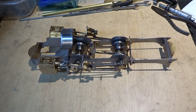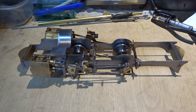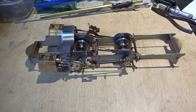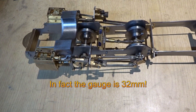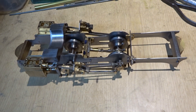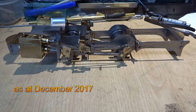So how far have I got with the Darjeeling Class B? I've sort of got a chassis sorted out, part completed, and here it is. It has working - or will be when finished - Walschaerts valve gear, that's all this business here. It will probably run on either 32mm or 45mm gauge on the garden railway. Really no drawings used, just making it up as I go along by eye. The chassis does roll. I haven't tested it on air yet because I haven't made the valve cover yet, so there's no point putting it on air. But that's the chassis so far.